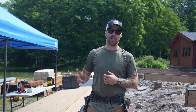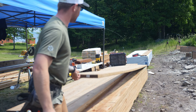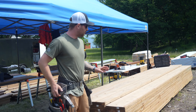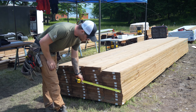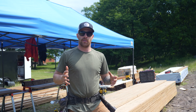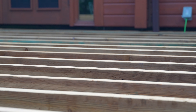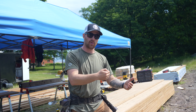We're ready to start running some joists. Before we install them we need to do two things: we need to crown each joist — it's easy to do while it's in the pile. We'll pick up each framing member, have a look at it, determine which way the crown is, and make a mark. Secondly, before we start running our joists we need to grade all of them — measure each one and label them by size. The reason we grade all our joists before installing them is if we don't, you're going to have high and low spots. The deck board follows the consistency of the framework, so with high and low members your boards are going to be uneven. If you grade them all prior you're going to eliminate most of that.